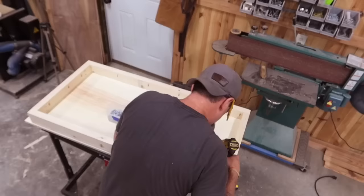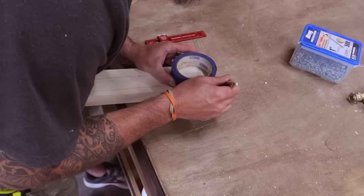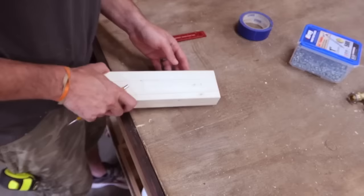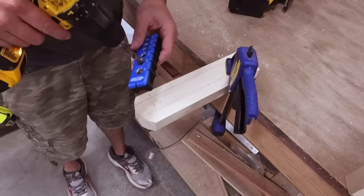To attach the three-quarter-inch top, we'll be using a one-and-a-quarter-inch pocket hole screw. Now we need to make our legs. We need to mark hole placement at one-and-a-half inches in and one-and-a-half inches down, and the ends need to be rounded at least a half inch in. I'm just using a tape roll for this. This will allow the legs to move without touching the bottom or hitting the back of the board, and we can cut this out with a jigsaw.